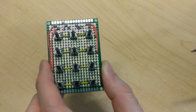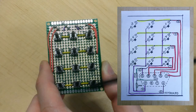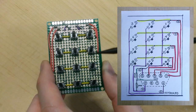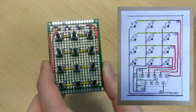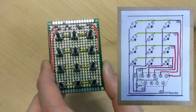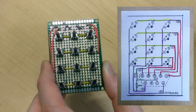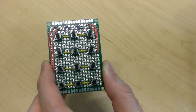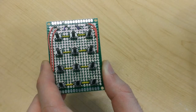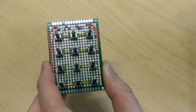As you recall from the schematic, the resistors specifically attach columns 1 and 2 together, and then the intersection of those resistors goes to the output pin. So column 1 is the column that has numbers 1, 4, 7, and I think the asterisk. That means we have to orient this board in the way that we are actually going to install it into the case, and then assign our rows and columns accordingly and then put the resistors in place.